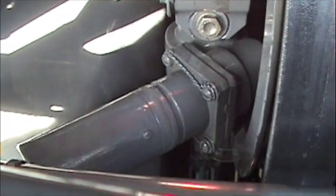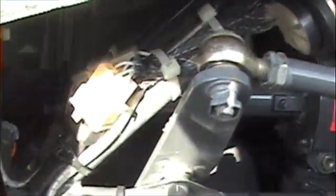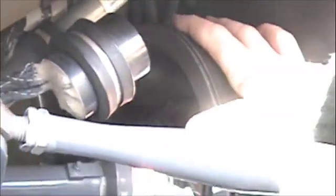That's on there nice and secure. Nice safety wire. Here's the belts once again — we're not done back here. The belt follows the drive shaft back a little ways. Right here is the middle flex plate and yoke flange. We're going to use our right hand, push it right here, just keep doing this and follow it all the way around. There are four jam nuts or paddle nuts. Make sure there are no cracks, no bends in the flex plate or yoke flange.